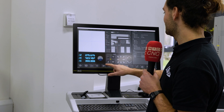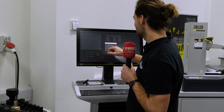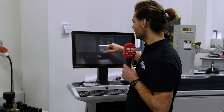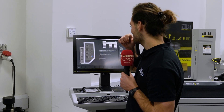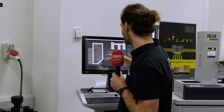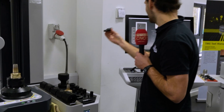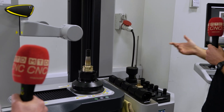Correct. We already have a pre-loaded program. Within that program, we have all of the nominal information required for the tool. At this stage it's actually going to ask the operator what they want to do. So I pick the setting sleeve — this one here — because it's telling me how to do this, all indicated on the screen. So I've done that.